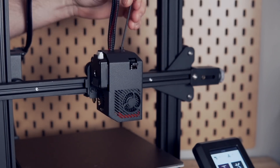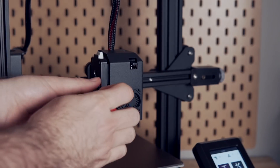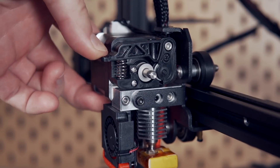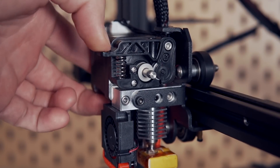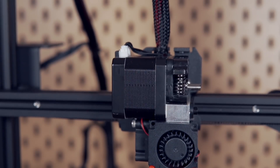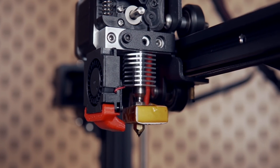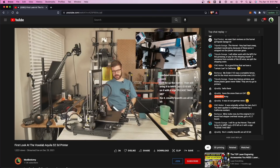On stream, we took off the housing for the extruder and hotend, and what we found was a bit underwhelming. The extruder is a pretty standard low-cost plastic extruder with a single gear, and the cooling fan is very, very small — the fan shroud only hits the part from one side, so it's really not going to be doing you any favors when it comes to part cooling. The hotend did look fairly unique with a hexagon shape. We started a print that was looking really nice, but because there is no filament runout sensor and the strands of filament are incredibly small, it ran out about midway through the print.